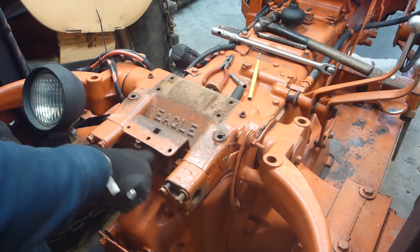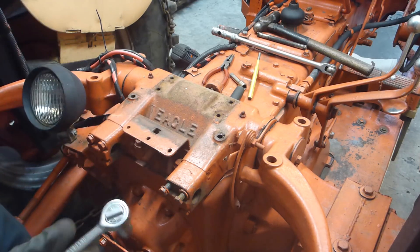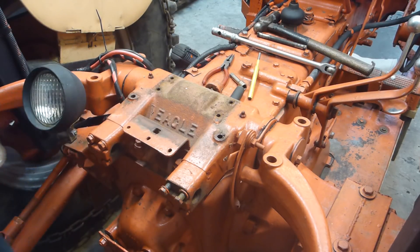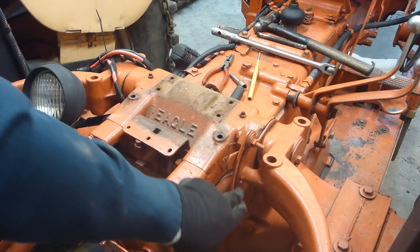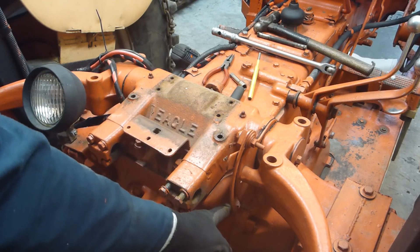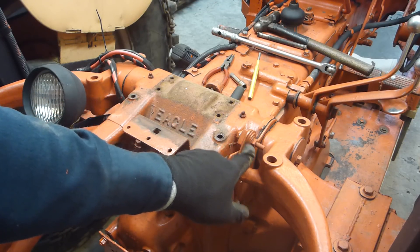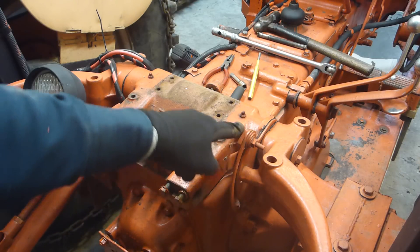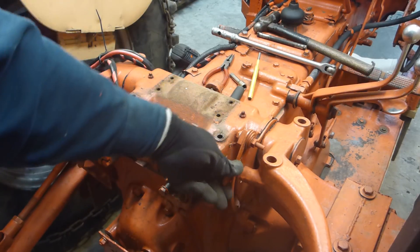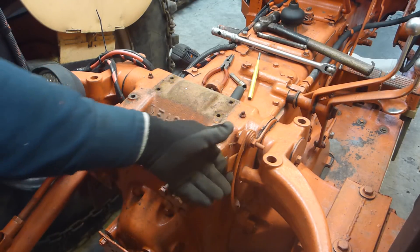There are two bolts under this bracket that up to now haven't been useful for any reason — except to retain some dead leaves. This lever is linked with a device which is slotted, and it has stoppers up and down. This lever is fixed. Whenever this slotted device reaches the stopper, it disengages the lever to make sure I don't lower or lift the arm too far.